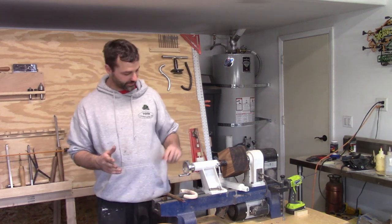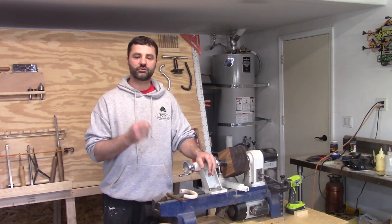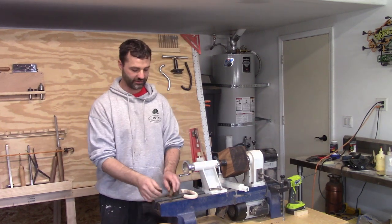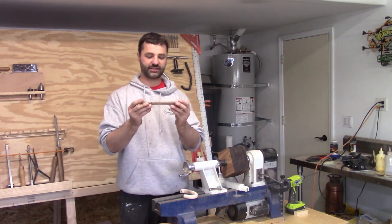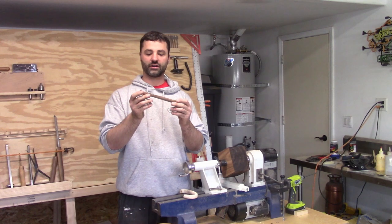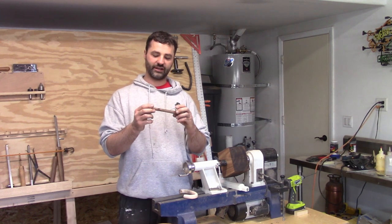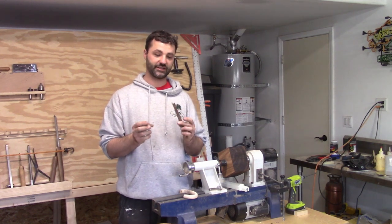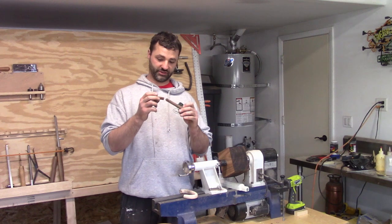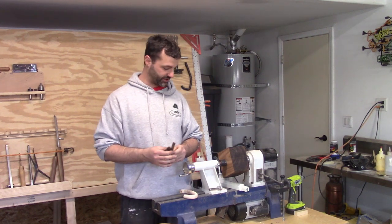So I thought of another idea. I've never done it before – I'm going to steam wood and bend it, and I wanted a curl effect. I turned a piece of mesquite and boiled it for an hour, then set up a jig. But mesquite is a very hard wood – it did not want to bend. It was bending a little bit and then it just snapped.